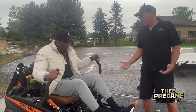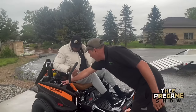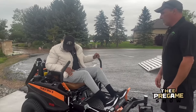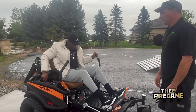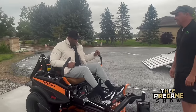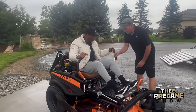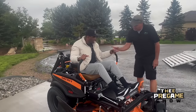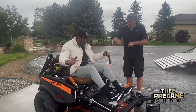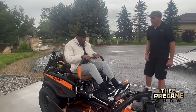Yep, you're locked there. And blades off too — same thing as your other machine. So right now it's ready to start. Just start it. And then if you try to put your handles in right now, it's going to kill it because your brake is going off. Next step — brake off. Brakes off. And then your handles in. Now you're ready to go.